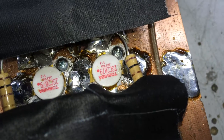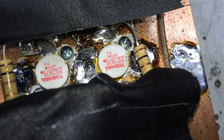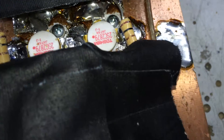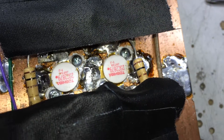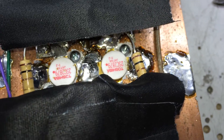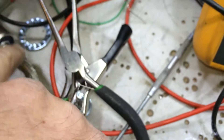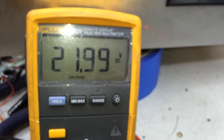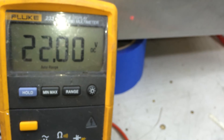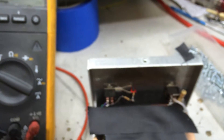Okay, here we go. X-Force test, experimental prototype circuit 2-pill, using the Toshiba 2SC 2879 red dots — lot 1-J, which I think is the current lot RF Parts is shipping. Going through a diode for protection to short stuff out, which is why you get the voltage drop. On the last test I was at 21.7 with DEI; now let's see where Toshiba lands.